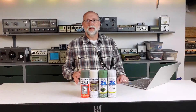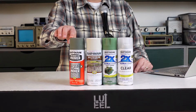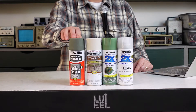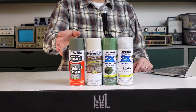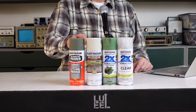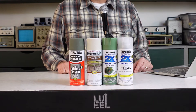I thought about sanding the entire surfaces of all the parts before applying the primer, but I didn't — my thought process was that Heathkit didn't do it back in the day, and their factory paints generally hold up well over the decades. What I did do is use a self-etching primer as my base coat after wiping the surfaces down with acetone to remove any surface oils. These self-etching primers contain a mild acid which helps break through surface oxides and are specifically recommended for use with aluminum.